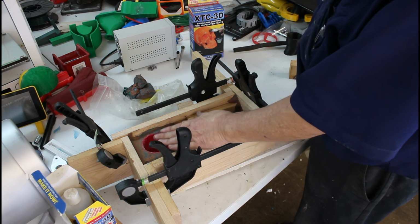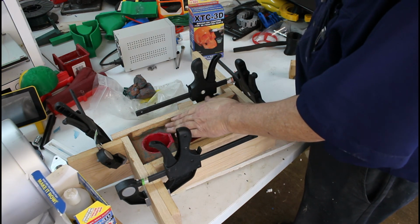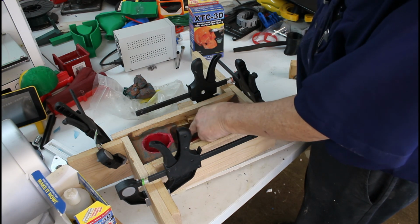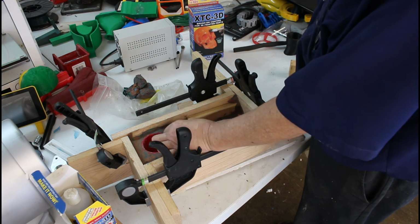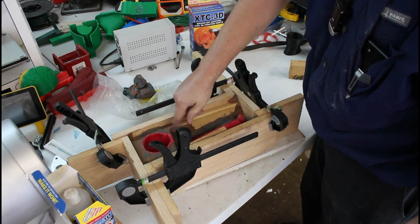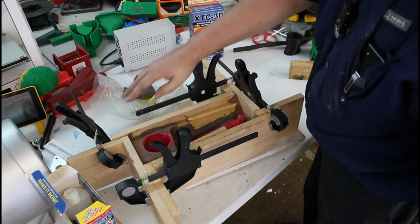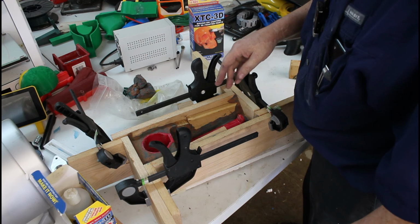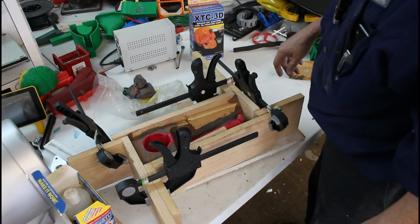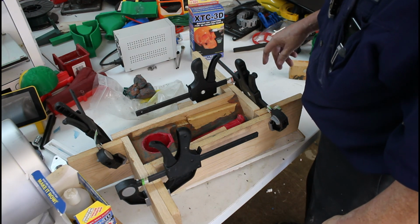Also in this here, of course, I'll pour this all the way up level to the top, or close to the top, and I'll lay a popsicle stick in here because this wall right here will be the same thickness as this. It'll be the only thing holding that up, and so you need something to keep that straight so it doesn't slouch over into the part when we do the molding. So there you go, half the job, and we'll be back when we start mixing up and do the pour.